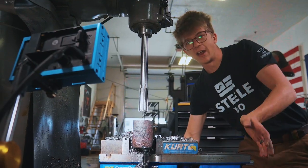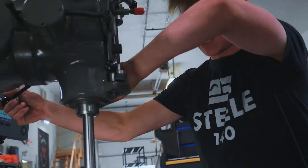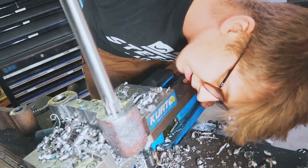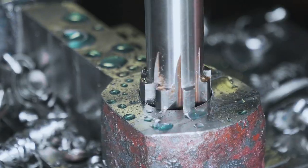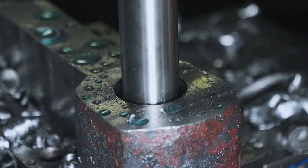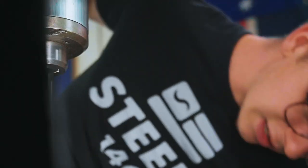I'm a little nervous — it didn't do much cutting, it just went into the hole. Which is worrying, because if the reamer wasn't cutting and moved around, it may have made a wider hole than anticipated and we might not get the right fit on the bronze bushings. I'm going to ream the next hole too — maybe it's different there. It started to cut right at the bottom, maybe this thing has tapered the whole way down. It's cutting now, just only right at the bottom. Proof's going to be in the pudding.